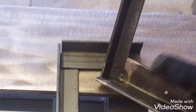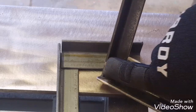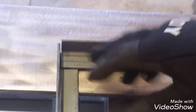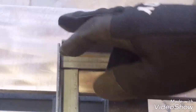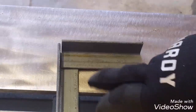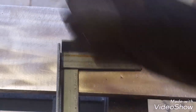The angle on this has been made by coping the angle iron. You can see it's a straight cut — straight and straight — and it's pretty easy to do. If you think about it, this joint will make a stronger joint than just a 45-degree miter, because that 45 has just one straight linear line for that crack to fall. With this one, the crack would have to go and weave its way through all of them, and there's three planes for it to do it, whereas there's just two with the 45.